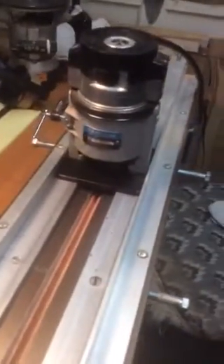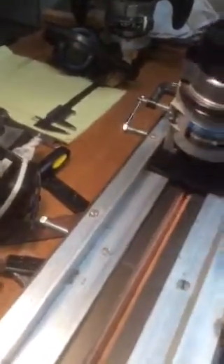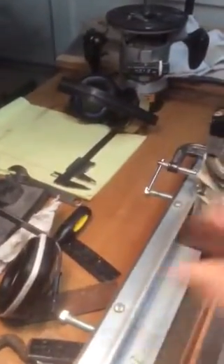Most of the stuff I'm making here is just Fender-type stuff, bolt-on necks and things. After you get that together, you just put your trimmer in there — or whatever gadget you want to use to cut your slot. Just make sure you've measured the width to put these two outside guide pieces in. You turn the machine on and make cuts. You can make several cuts at a time — make a cut, unlock it, turn it down, drop the bit down some more, and then your stops. Bingo, that's it. Got a stop here, a stop there, and when you pull it, it's just like that.